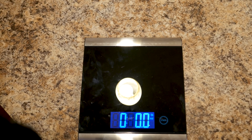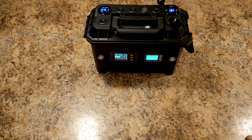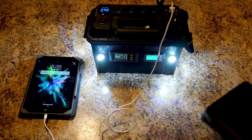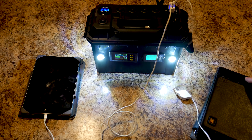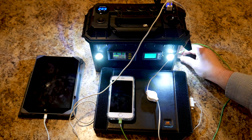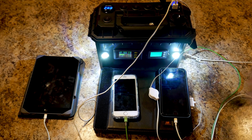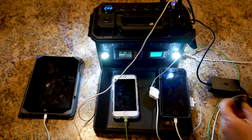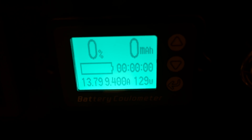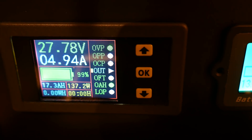The new power box weighs just under 10 pounds, making it very easy to carry and transport. Setting up to do my first charge with two iPhones and two iPads along with a Mavic 2 drone battery. Total power consumption used was between 130 and 140 watts, or just under 5 amps of power — everything worked as expected. The largest consumption came from the Mavic 2 battery, which takes around 90 watts to charge. I have a 10-amp fuse on the 12-volt accessory for close to 140 watts of available power. Larger fuses can be used, and the total max power of the buck converter is 300 watts.